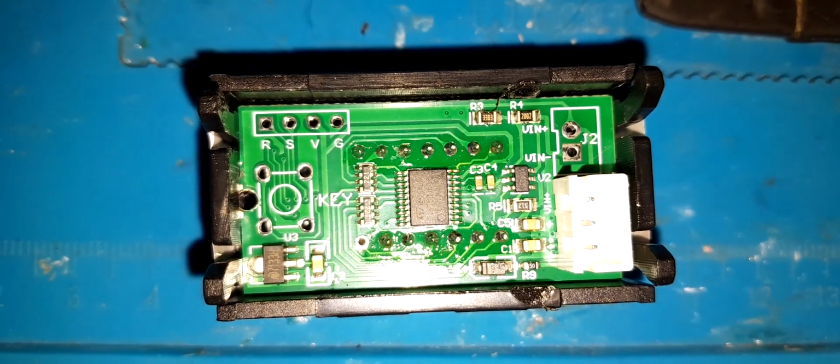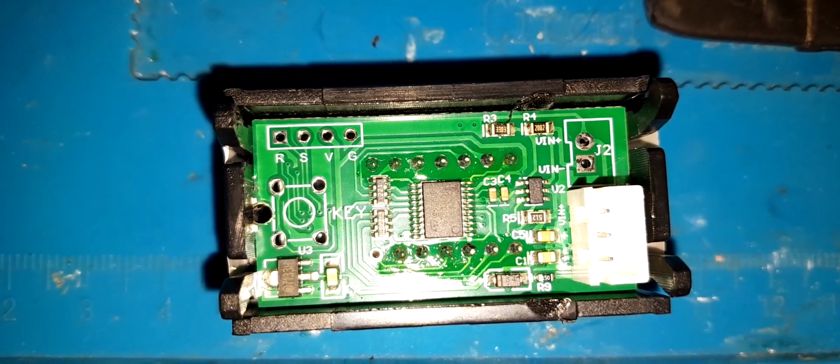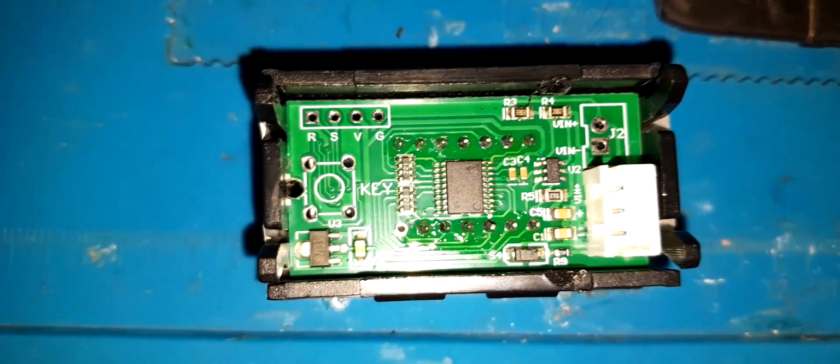Going into the regulator, coming out to a little ceramic capacitor, and then that trace, I should probably point to you guys, that's the resistor I'm talking about. Power's going through that, through the diode, into the regulator, coming out, being filtered to ground, and it's going off over here and powering things.